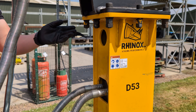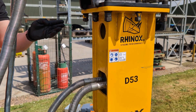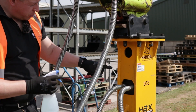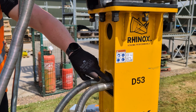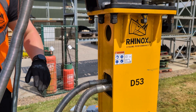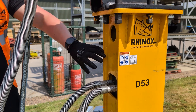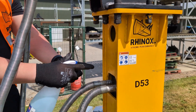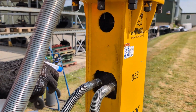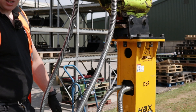If when the gas is checked it has lost 25 psi or more within a 24-hour period, there is likely a gas leak. To check, spray some soapy water around the refill point and around where the segments of the breaker are connected on the internals. This breaker being a smaller one is more compact — some larger ones have a larger opening to check for further gas leaks. As you can see, there are no bubbles on this one, confirming there are no gas leaks here.